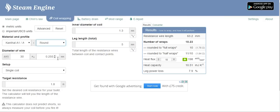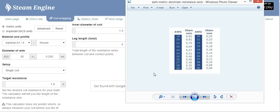You have AWG and millimetres, and a lot of people seem to get confused about this. A lot of people will say they have 0.28, but what they actually mean is they have 28 gauge — 28 AWG. If you look at the chart here, 28 AWG is actually 0.32, not 0.28. It's important to point that out because if someone says 0.28 and you think that's 28 gauge, it's not. We buy 0.3 wire which is advertised as 28 gauge, but technically it's between 29 and 28 — it's fractions of millimetres, so it's not going to make a huge difference unless you're sub-ohming and really going for precision.